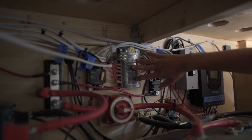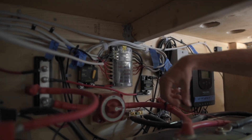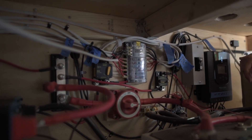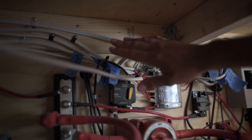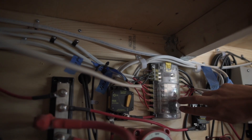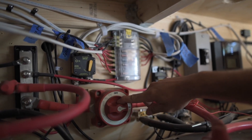From the battery bank we have wires to our fuse box, which powers everything involving direct current — basically everything but our wall outlets. Also from the battery bank we have wires going to our inverter, which supplies us with our wall outlets. All these circuit breakers in between just protect wires from overheating in case there is a surge in power. These positive wires here go to specific appliances — for instance, this wire I've labeled as the toilet fan, and this one is the fridge plug. We still have room for a couple more, but basically everything is taken up on this fuse box.